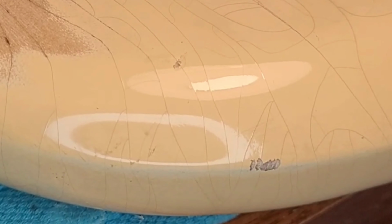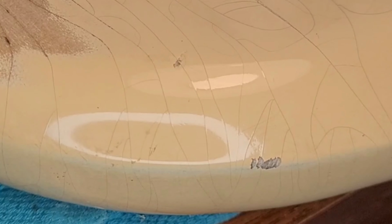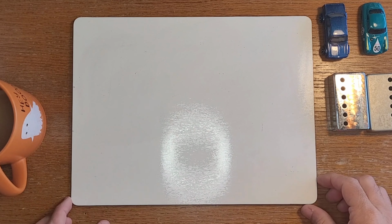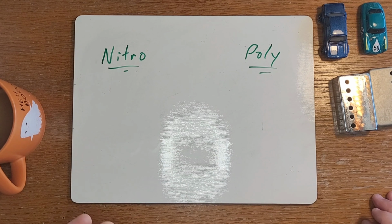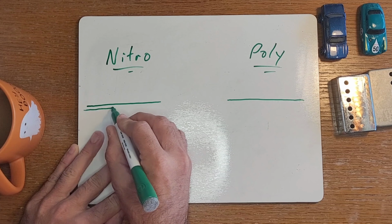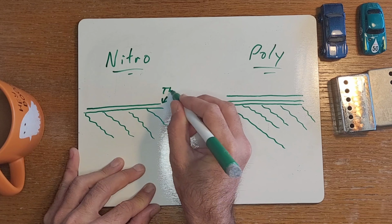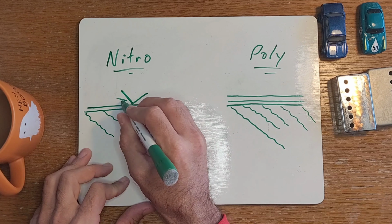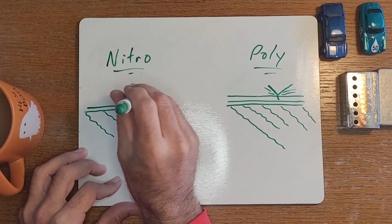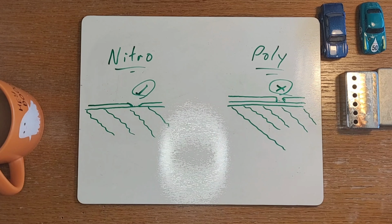You want just enough. Now that we've got those, let's see if we can make them a little bit more convincing. The first thing we're going to do is hit them with polish. What this does is round off the break. Where the damage is initiated and the blade dug in, you'll have a subtle downturn into the area where the finish is no longer. If somebody looks at it really up close, they'll see those rounded edges and assume that break must be 20 or 30 years old, the amount it would require for those edges to become rounded by natural handling.